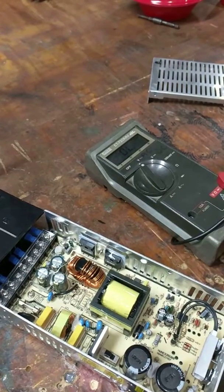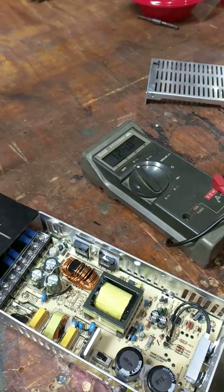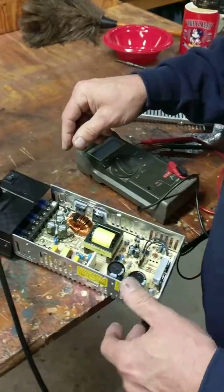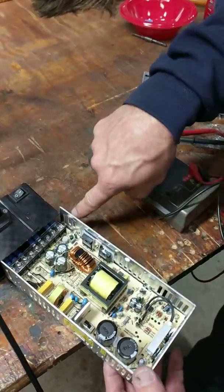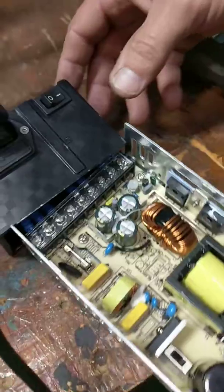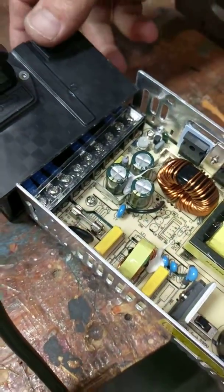So I've got good volts from the power cord. Now I'm going to plug that in — and I get nothing. There's no LED, no matter where the switch is. The other fuse on the board of the power supply is also good.